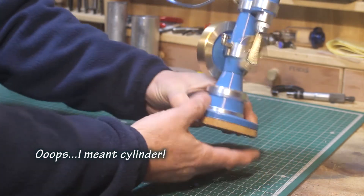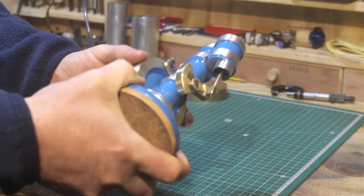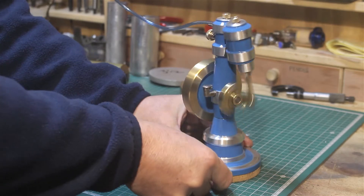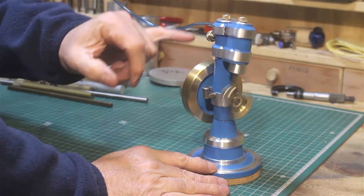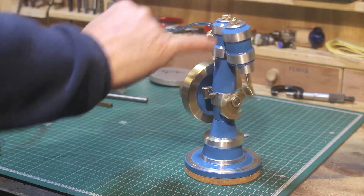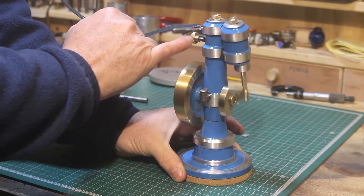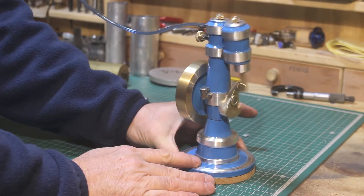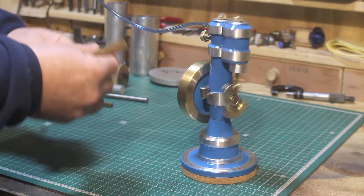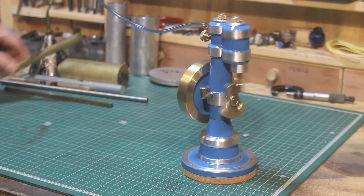You can see that the piston is offset from the center. It's connected through with a piece of four millimeter silver steel which is threaded into the cylinder side, then a clearance hole through, a spring, and a little turned knurled thumb screw made from a piece of half inch brass. The two little oiler plugs were also turned from the same piece of brass.